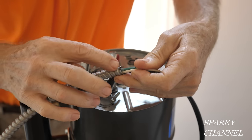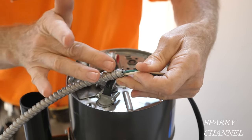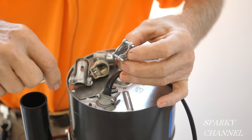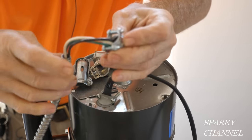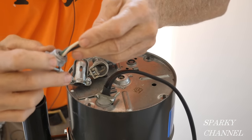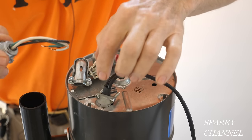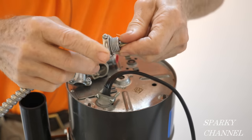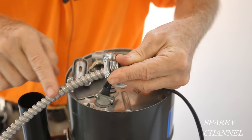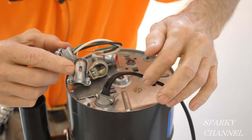Now, if you have metal clad cable like this — in older houses you'll often have metal clad cable, generally steel (this one is aluminum but it suffices for demonstration) — you need a different kind of cable clamp. It goes in here like this and clamps onto the metal cladding. Put a little red head right in here and tighten it down well to the disposal, because this metal clad area is often the ground in an old house. It's very important that it be clamped well to the cladding and screwed in well to the metal of the disposal.